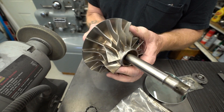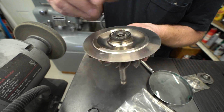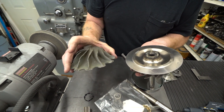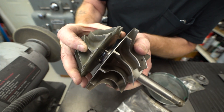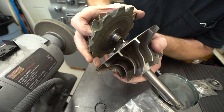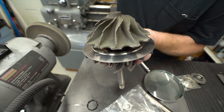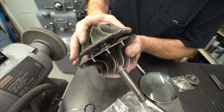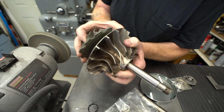This one's a new assembly here. The hot wheel actually goes on here behind the seal plate. This is one that came out of a burned-up engine and was still running as a matter of fact. This actually goes on here and this is pressed together — it's got three points that this can go together in, three different positions it can fit in. We put it in a press over there and press it together, then we put a bolt in here — it's a special bolt — and we tighten that up and torque it to the right values when we go to put the engine together.